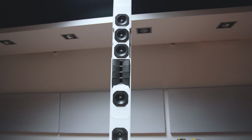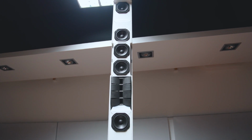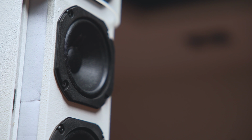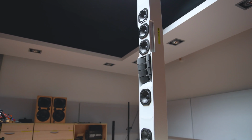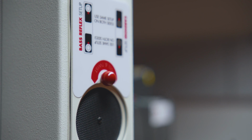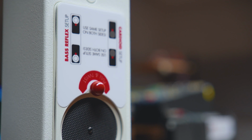And this is when we came up with the idea of a fully passive three-way system with basically three nice ideas that came together in this system: the cardioid mid-frequency drivers, the high-frequency array that is kind of steerable, and the bass reflex / cardioid switchable low-frequency element. It's definitely not a column speaker that you find around every corner.